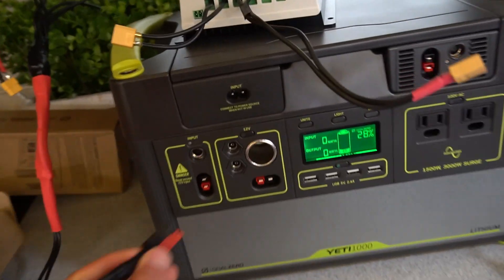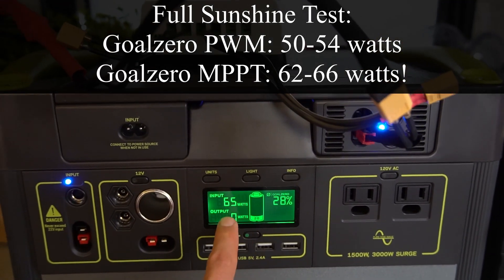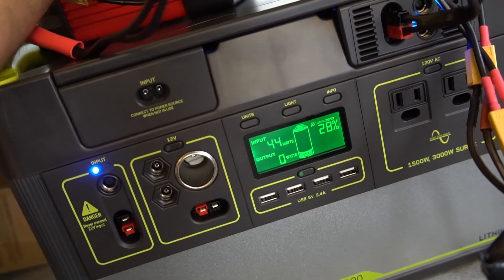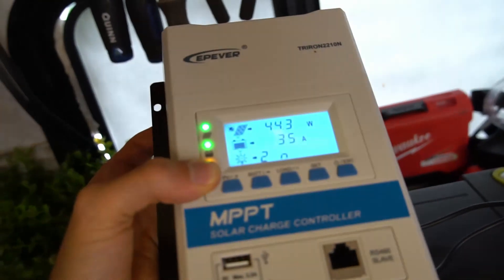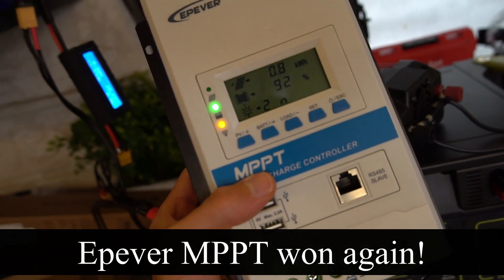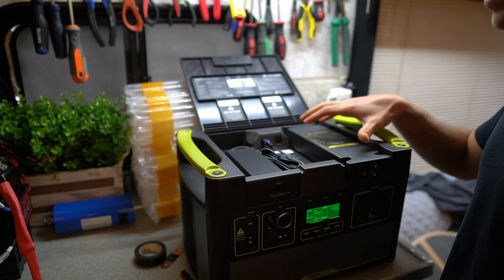In low light circumstances, the Goal Zero MPPT is not that great — practically the same output as the PWM. Now with more sunshine, we're getting 50–54 watts with the PWM and 64–66 watts with the MPPT, a noticeable increase. Comparing the EP Ever MPPT again in sunshine: 44 watts on the Goal Zero MPPT and 48 watts on the EP Ever. Switching panels gives consistent results: 40–41 watts on the Goal Zero MPPT and 44–45 watts on the EP Ever.